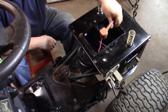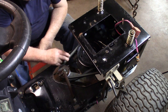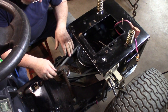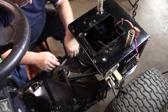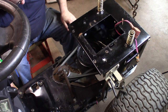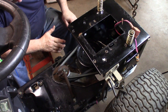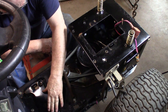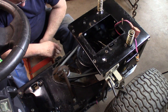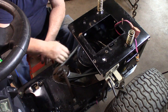With a little bit of wiggling, off it comes. Alright, so we're in. I know what you're going to say - that was an awful lot of work just to get a look at these belts. But I want to see what's going on here. It seems to me that when I push down on the go pedal, it doesn't do anything, and then all of a sudden it jumps ahead almost at full speed. I'm trying to control how fast it accelerates - it should be a nice smooth acceleration.